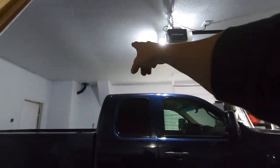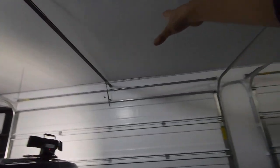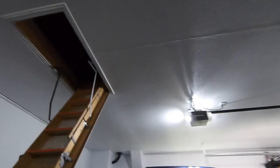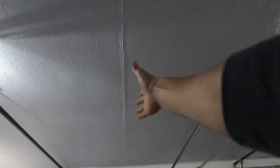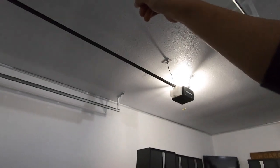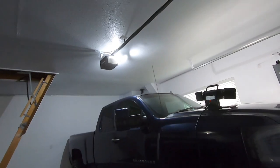The perimeter is all done — wires are through the ceiling, but still need to be wired up in the attic. Now it's time for the column runners straight across the ceiling. There's a crack in the ceiling that I patched and repaired — it's still really ugly — so I'm going to use that as a guideline to mount my lights, which will cover it up nicely. Then I'm going to do one additional row of lights here and one last additional row over there as well.